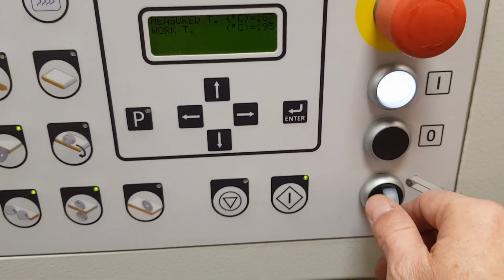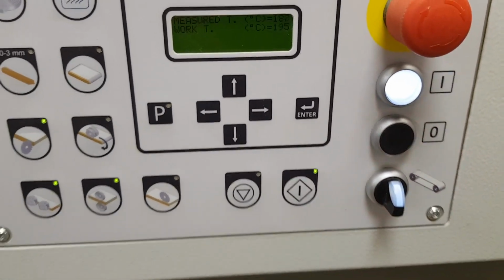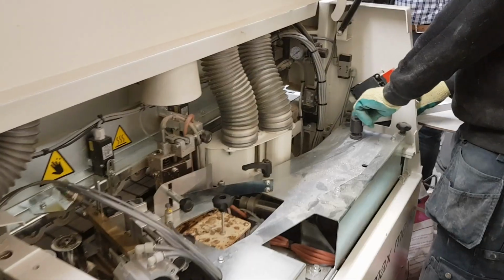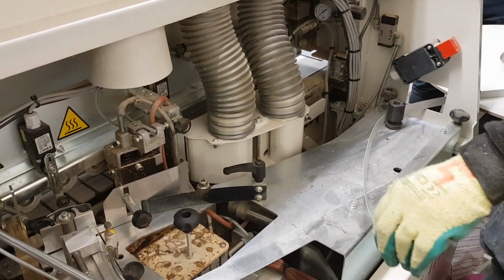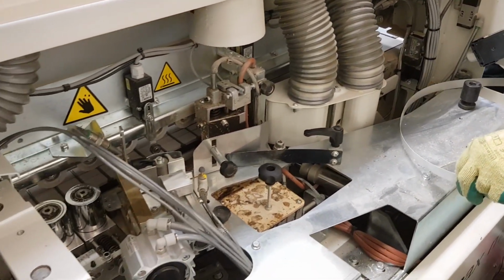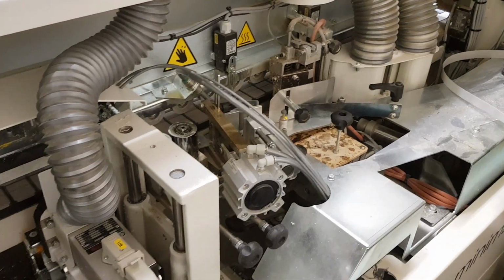We turn on the motor and switch on the feed track, made of pads coated with high friction rubber fixed on the 3/4 industrial chain. The glue unit, with a new innovative system of self-lubrication of the glue pot, allows a more extensive use of the edge bander without the necessity of lubrication.